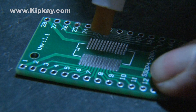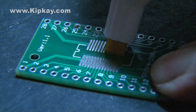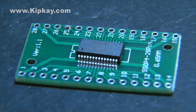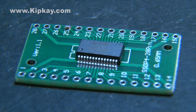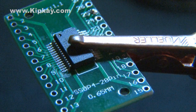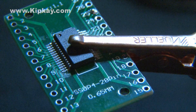Okay, let's get started. We're going to apply the solder flux to the circuit board contacts — this flux helps the contacts to attract the solder. Now it's time to lay the FTDI chip in place on the board. Pay attention to pin 1 as it corresponds with the notch on the circuit board. It will definitely help if you can secure the chip to the board once it's in position — I'm using an alligator clip to hold it all in place.